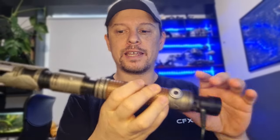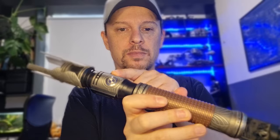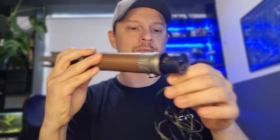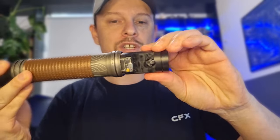In this case, I can use the charger cable as a kill key, and I can see the power is cut because the button doesn't light up anymore. And then I need to do these steps, and this is press the main and auxiliary button at the same time and keep them pressed. And while I'm keeping them pressed, restore the power to the board by taking out the charger cable.